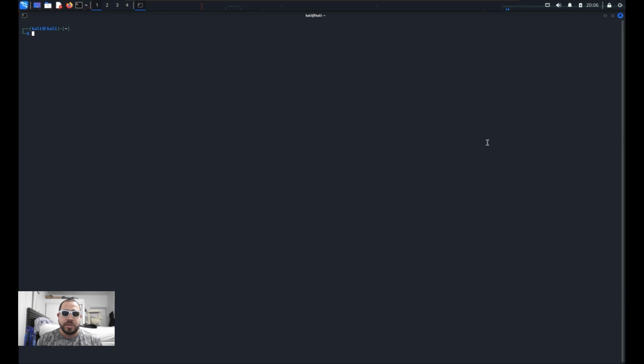I like it because Ublox gives you another app called uCenter, which I'll show later on, where you can actually update the firmware. You can change whatever you want. So if you're going to be using it stationary, on a drone, on a boat, or in a car, you can set up the baud rate and everything specifically for this M8 Ublox chipset. You can set the firmware on it permanently, or you can just reset it. That's the reason I like it.